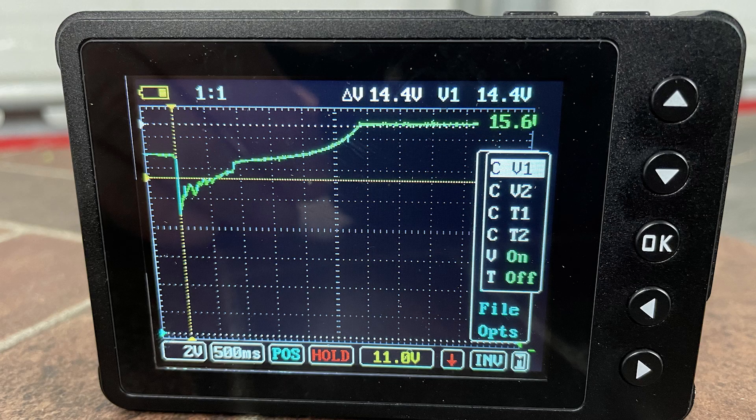This is charging voltage and it should generally run between 13.5 and 14.5 volts. But if you see something outside of this range, don't condemn anything quite yet. Many OEMs use very unique charging profiles in the ECM to maximize battery efficiency while reducing the load on the engine and the alternator. So make sure you check the OE service information to see what they say is correct for their vehicle. And one thing you can't see on your meter that you will see on the scope is how long it took for the battery to recover from the starting event.